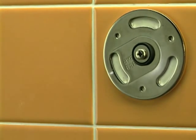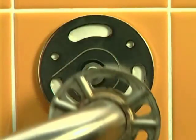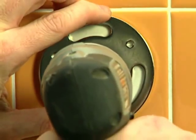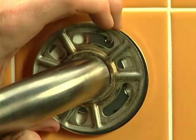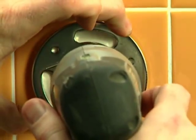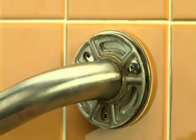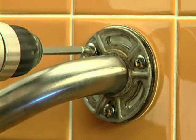When the mounting plates on both sides of the bar are secured, the arrows and the open end of the horseshoe markings should face each other. If the mounting plate and the bar flange don't line up perfectly, just loosen the center screw. Secure Mount's user-friendly design makes it easy to adjust the final position of the plate. Then re-tighten the screw and mount the grab bar, using three of the six small screws and washers to mount each side of the grab bar to the mounting plate.